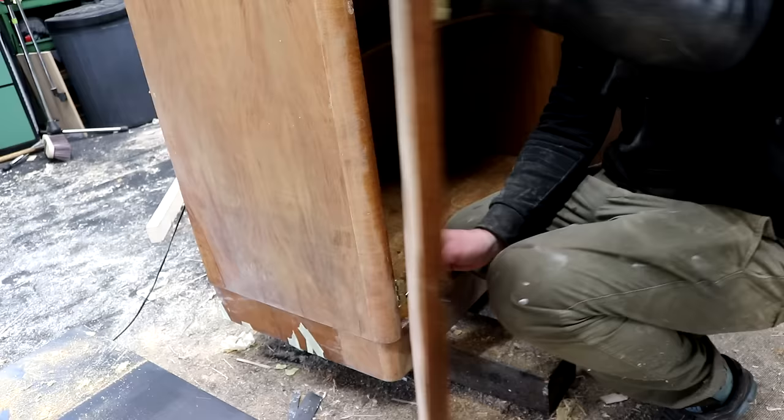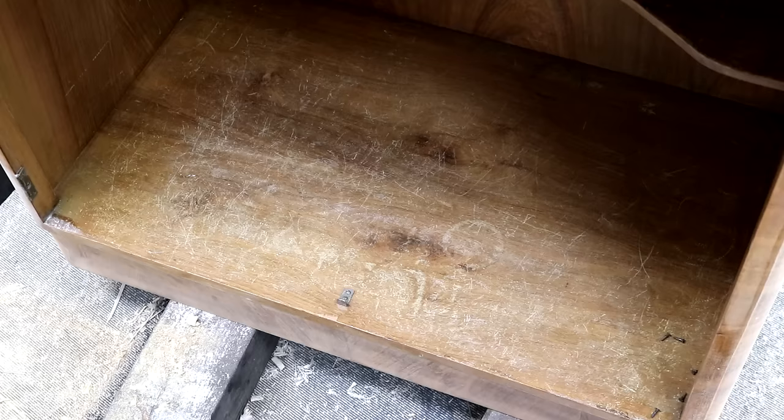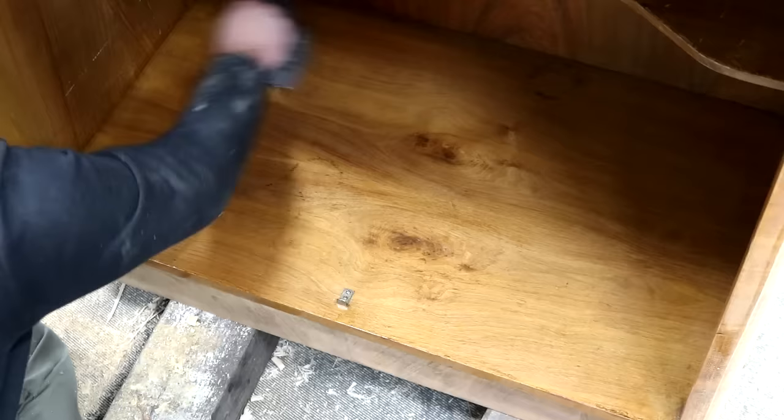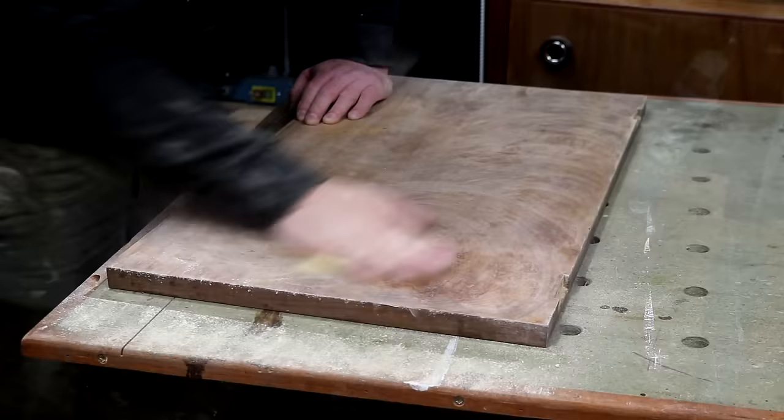Here I'm removing the cabinet doors so I can work on them separately. Even though I'm not meant to be working on the inside, I did just wipe on some shellac in places where the old finish had been scuffed and scratched over time just to tidy it up a little. I was a bit apprehensive about removing the finish from these doors due to that highly figured grain, but you can see here that they really needed some attention due to all the cracking. The varying grain direction was going to make this difficult and I didn't want to damage the veneer, but I managed to do some areas with the scraper and the rest I did with sanding.